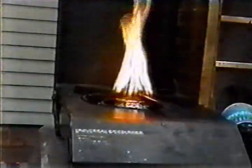Now that we've got it in there, we're going to do some more welding on it. We're going to make sure it doesn't come out. It's that simple. Now we're going to get it out of here and let it cool off. You don't cool it with water — just let it cool naturally. You do not want your aluminum to cool fast, especially aluminum castings. Let it cool slowly and you'll have a good job.